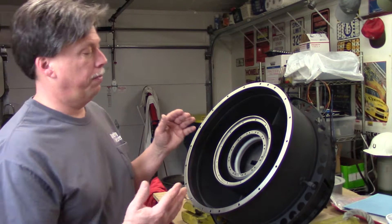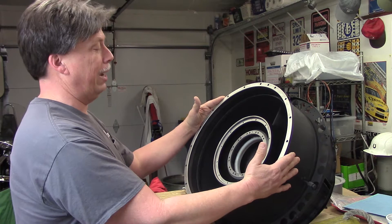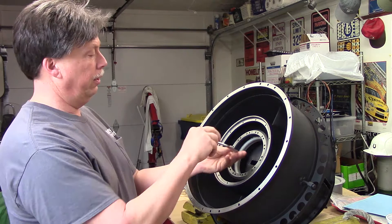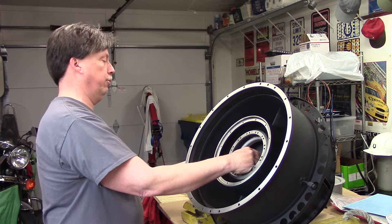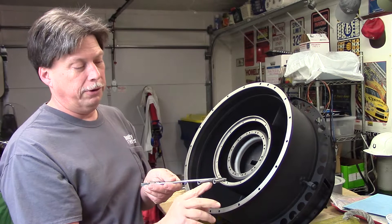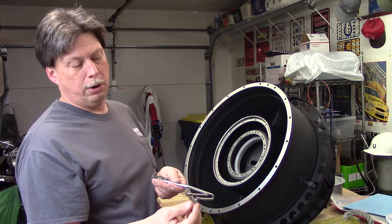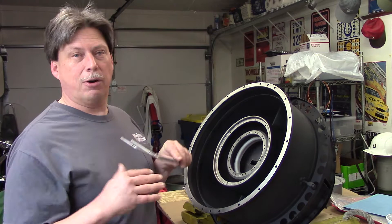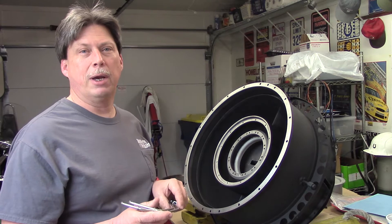Long story short, the function of this component is many and important. It's the back end of the engine — it holds the end of the shaft in place. The bearing itself is fed with plumbing lines, as we'll see during reassembly. These lines are tucked through a strut and connect out to the outside. One line feeds an oil mist and fog, and one feeds air only. The air not only cools the bearing but gives a net flow of air through the bearing and out of the bearing housing chamber, keeping any heat or gases from entering the bearing housing.